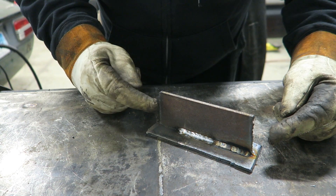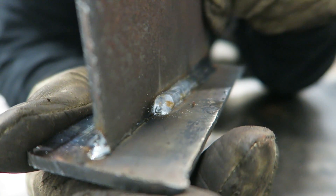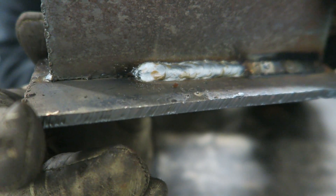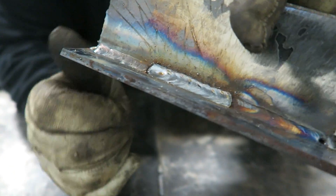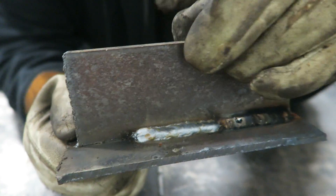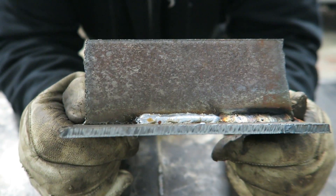I felt that pushing back - I don't know if you saw the metal was moving ever so slightly every time I welded. This bead is super heavy - you see how fat that bead is? You'll also notice what's missing: there is no heat affected zone, and I'm holding this in my hands without burning my hands. On the other side you can see the heat marks, but on this side there are no heat marks, which usually means that the weld didn't penetrate deep enough.